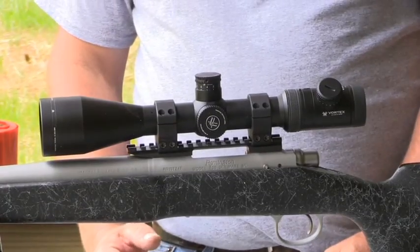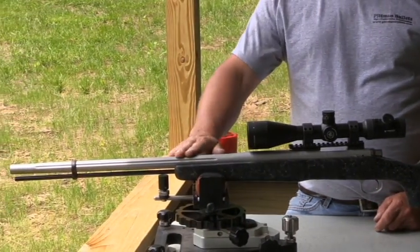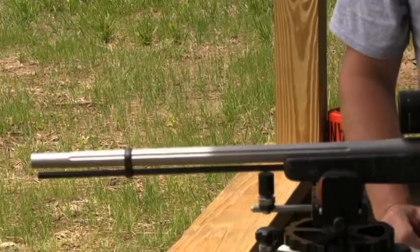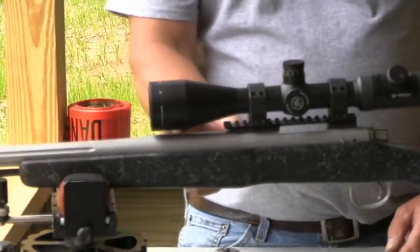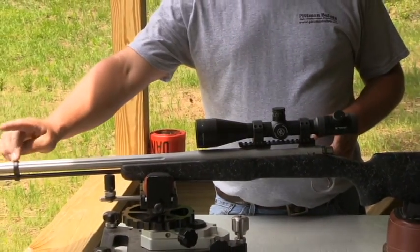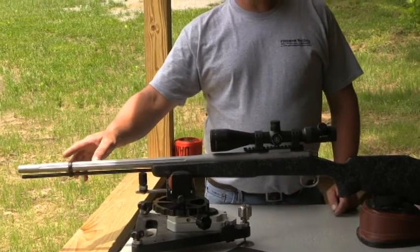You guys are probably familiar with my ignition system and how it works. But we put a Brooks barrel on this gun. It's a number 6 fluted. We tried to maintain the factory look of the Remington Ultimate Muzzleloader, so we stayed with about the same contour barrel. We did extend the shank on the gun here, so we've got a 1.250 straight for 4 inches. And we use the factory ramrod ferrule, little guide there. That's the factory guide that comes from the Remington gun, and it fits this barrel just about perfect.